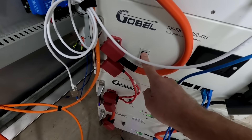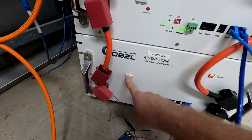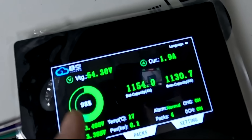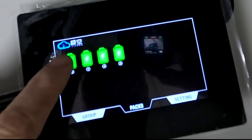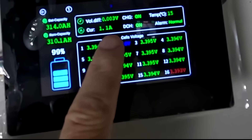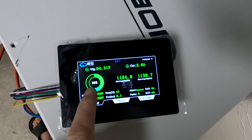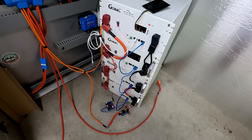Battery is on, this one is on, bottom battery is on. We've got light. We're on 54.3 volts charging with 2 amps. 0.3 amps in the top battery, 1.1 amp in the second battery, 0 amps in the third battery, and 0.3 amps in the bottom battery. We are at 98% state of charge. This is for the whole Gobel Tower of Power.